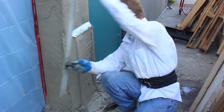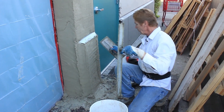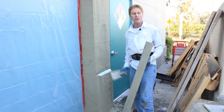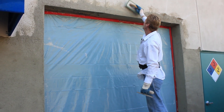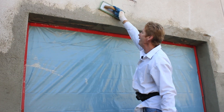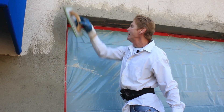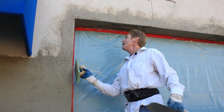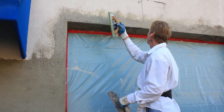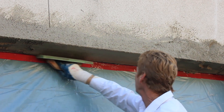I thought I'd show one last piece before we come back and start floating this and do the finish coat over it. What I'm doing now is I'm floating out my joints. Somebody might say, 'Hey Kirk, since you're floating it and bringing the aggregate or the sand out, can't you match that finish?' I can come close but I can't match it. When it's painted, it will sure show the difference of the aggregate. This sand that I'm using is Felton or plaster sand — it will show the difference.